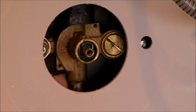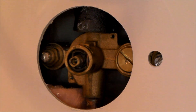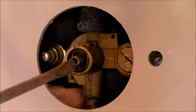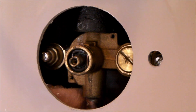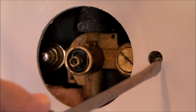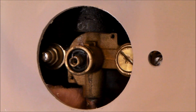This happens to be a Moen valve and it's 16 and a half years old. Perhaps the videos that are out there apply to newer valves — maybe that's the explanation. Here's the cartridge right here in the center. Right here is what I think they call the balancing spool. You'll see a screw here on both sides of the valve — there's one on the right and there's one on the left — and those are isolation valves.